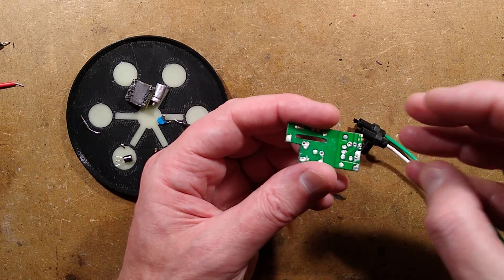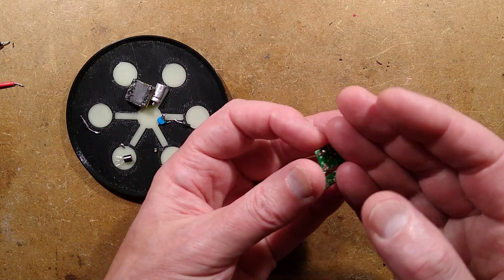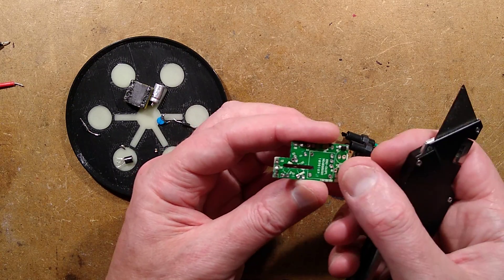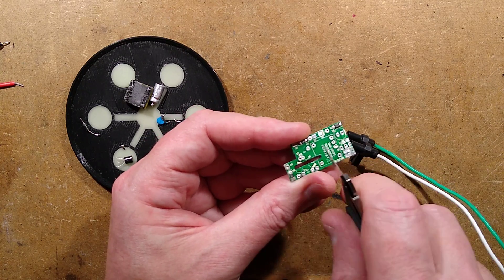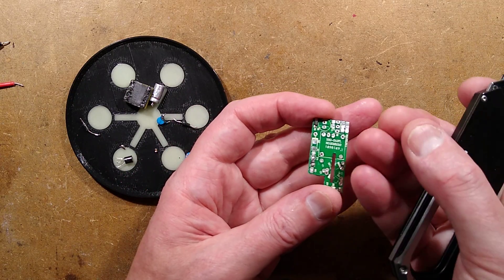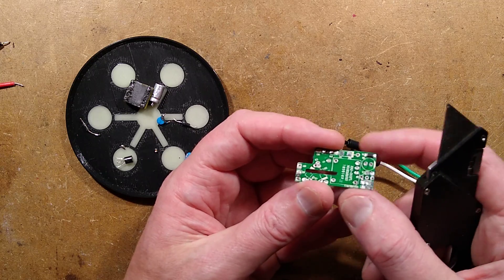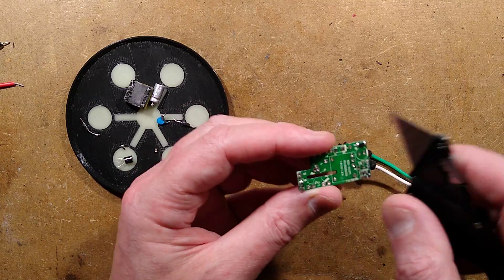I started off de-potting with acetone. The acetone softened the resin to the point that you could get a knife and actually peel it off. But it was just as effective heating it up and then using the acetone, because the acetone would only soak in to a certain depth — you'd peel down, then it would be rock hard again, and you'd have to soak it. It didn't matter if you left it overnight; it seemed to stop at a certain depth. Heat was the best approach, and then for the last remnants, a dip in acetone left soaking for an hour to get the last bits out.